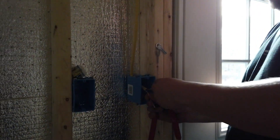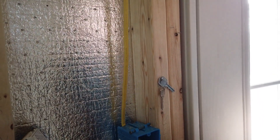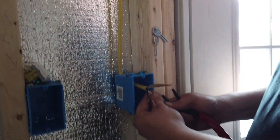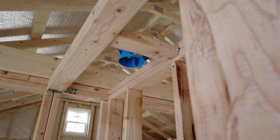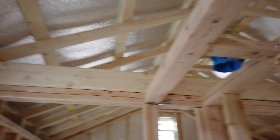So is this any different than the outlet? Yeah, so the white wire bypasses the switch. Essentially this wire here will just get wire-nutted to the other wire that is going to the light. The ground and the hot are gonna get connected to the switch.